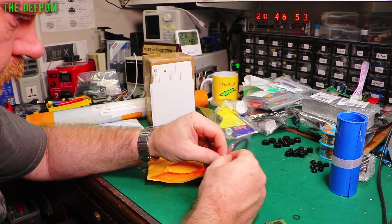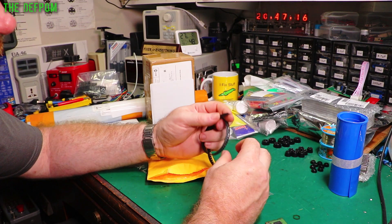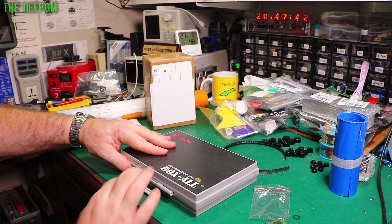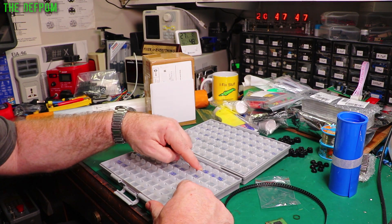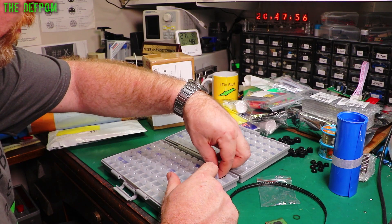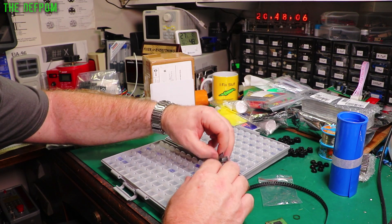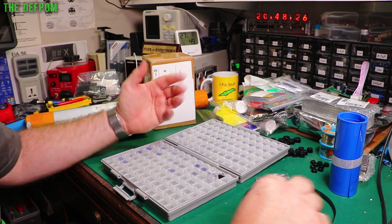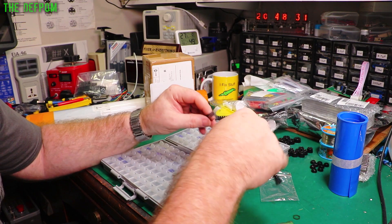These are potentially transistors. I think they say 2A - so these are transistors. I think these are 2N3906s. Let me check my stock. So here's my box of service/repair parts. I've got a whole bunch of 2N3904s but hardly any 3906s which are PNP transistors. Pulling those out - these are marked as 2A, so 2A is a 2N3906, or more precisely the MMBT3906. I've got a bunch of those which I need for my Datron project - using transistors to switch voltages to boost drive to some of the segments for the annunciators for the plus and minus symbols.